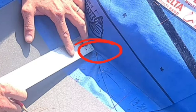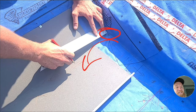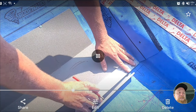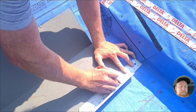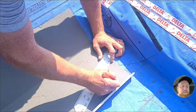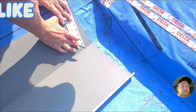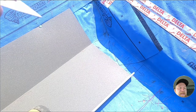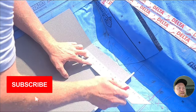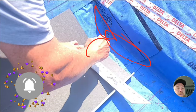Place the ruler on the miter line and step off of that miter line with your magic number. That's my final line — now all I've got to do is connect these lines. This is the miter line that I have now transferred from the wall onto my piece.